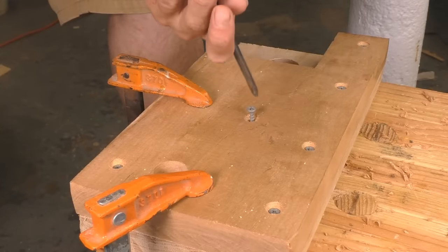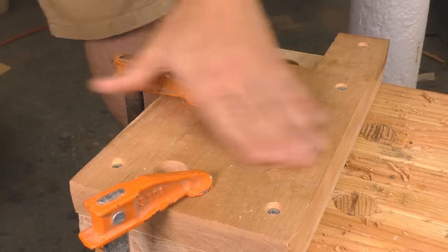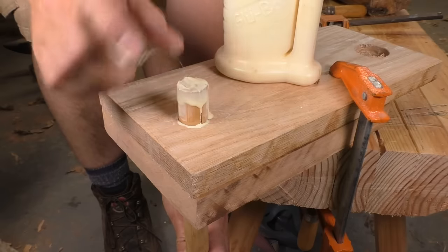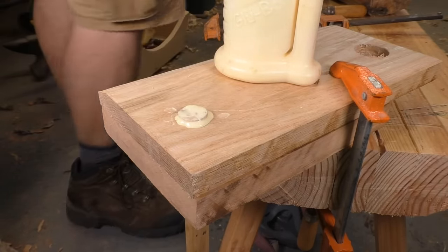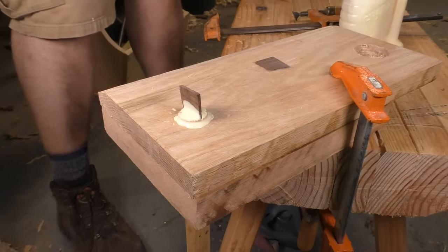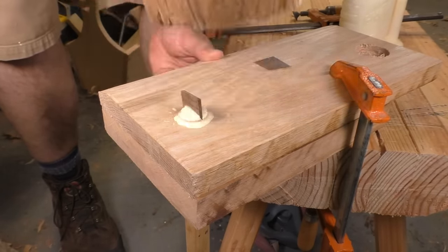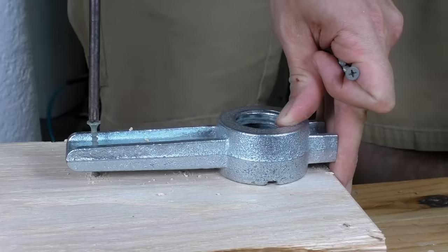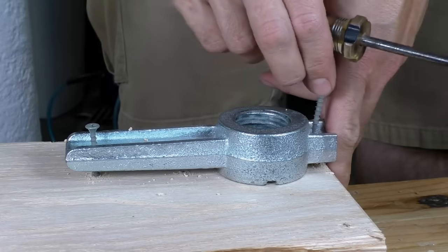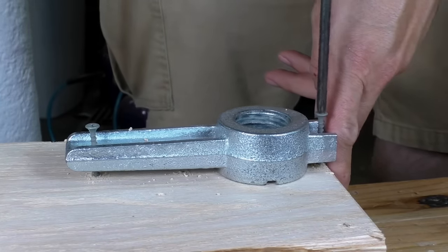You can attach the thick piece to the thinner piece of the jaw using any method you like — I'm just using screws here because it's quick. And finally we're going to add our guide dowel and install it permanently. I'm going to put some glue on it and then just wedge it in place — this is going to give us a super tough hold and we don't need to wait for the glue to dry because that wedge provides plenty of pressure. To finish up our vise, we're going to drill some holes into the nut and screw it to the back of the inner jaw. Once that's done, all your vise parts are complete and you're ready to test install.